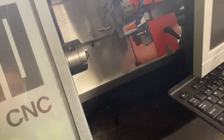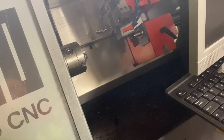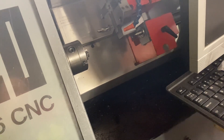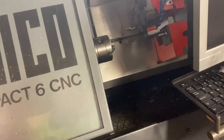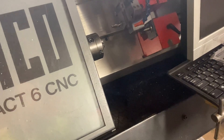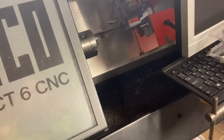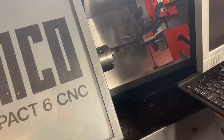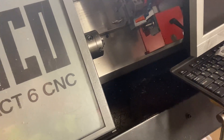It can run the program just fine today, and tomorrow I don't know — some sequence when I start the machine, it just ignores the tool table and runs into the workpiece the wrong way. I don't like it. This machine has sat here for half a year or so; I have not used it at all because I can't rely on it doing what I want. I'd rather use the manual conversion I converted to the XC609T, because that works like it should. I don't know why it loses the tool data, but I hate it.